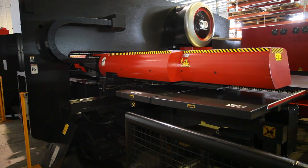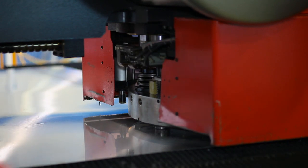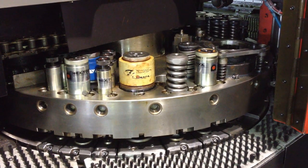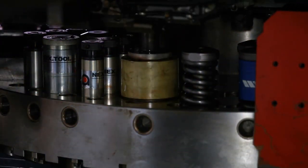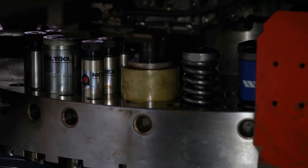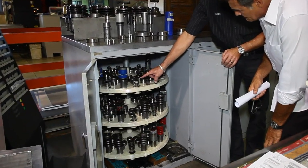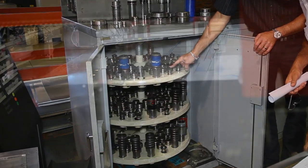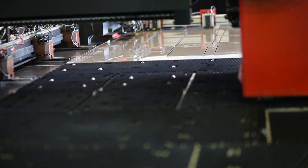The Turret Punch Press coordinates punching tools of various shapes and sizes that are housed in a circular turret, which then punches a combined series of holes in the metal sheet to cut out the exact required shape. The range of punching tool shapes held in the turret for each task is dependent upon your job's specifications. Just about any shape can be punched out thousands of times with extremely high levels of accuracy.